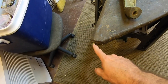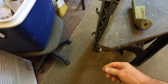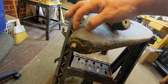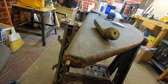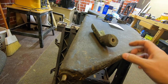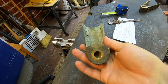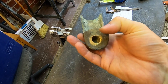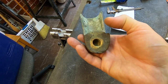The pin itself is now about three-eighths of an inch — it's kind of tapered and a little oblong itself, so this is shot. My understanding of how to fix this, assuming the rod inside is okay: you cut that off, drill it out to the size you want, thread it, and put the right-size bolt in, cut the bolt to length, and that's your new pin. I don't know if I can reuse this or not because it's oblong. I think I heard somebody say this can be filled in and then drilled back out again.